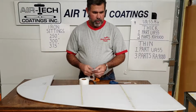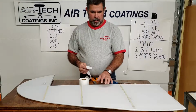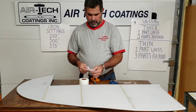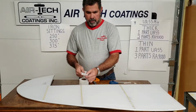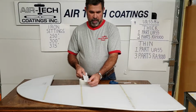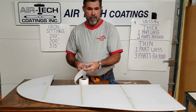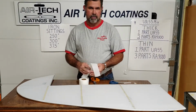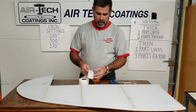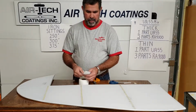A lot of times when you order medium fabric like this, the 102, that's what we call the medium fabric. The tapes to go on medium fabric usually is made from a lighter grade fabric. It's just usually one off, but the heavy grade fabric is made from this. It's not really something to worry about, but there'll be a heavy and a light tape. A lot of times we just like using the lightweight tape on these.